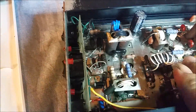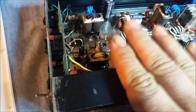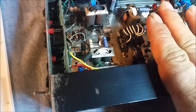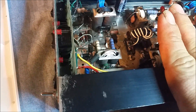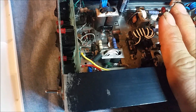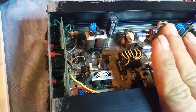Another thing I had to do was retune the input. Everything else was fine — I didn't have to tune the four-pill section in between — but I did have to retune the input because there was about a watt of reflect, and that is not good. I will not let an amplifier leave out of here with a watt of reflect on the input. That's a lot of power being dissipated from the amplifier to the radio. I'd rather try to get it down to at least a quarter watt; half a watt on some amps you just can't help, but a watt is just too much for me.